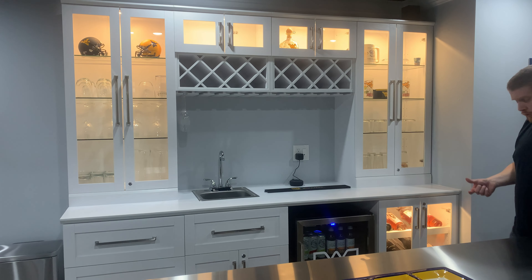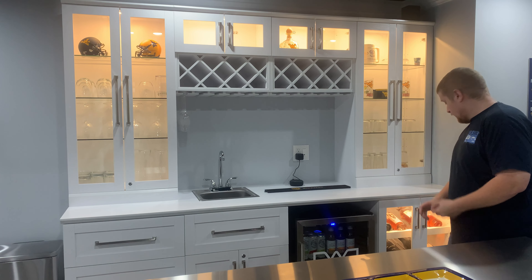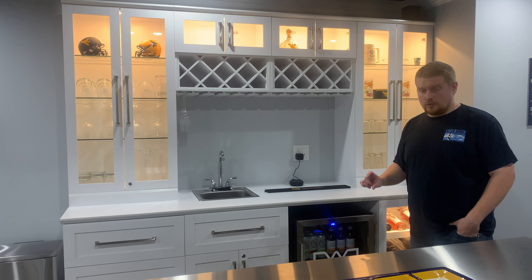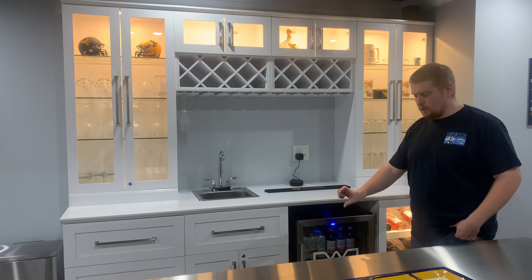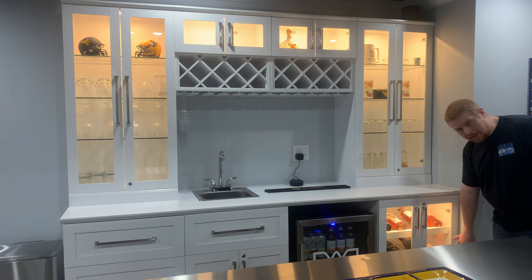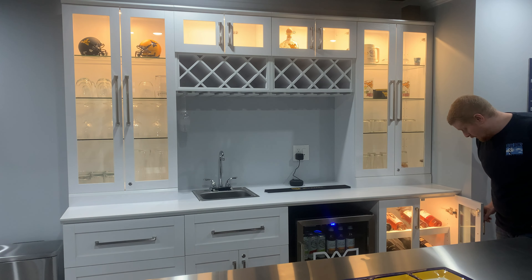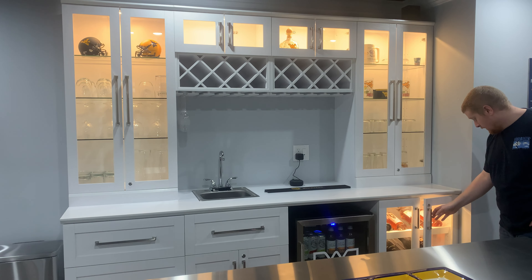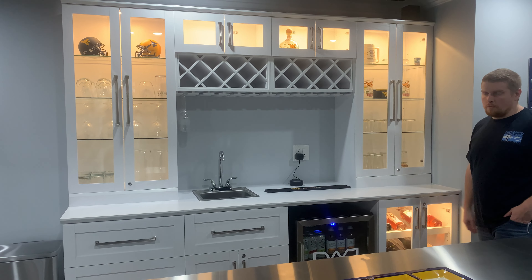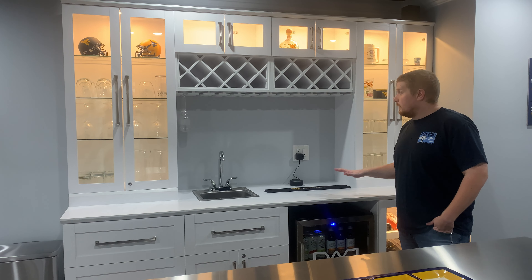Now on your base cabinet, the toe kick is a little slim. Our baseboard is a five and a quarter, five and a half inch baseboard — it's probably a good couple inches taller than the toe kick or base plate on these. So this wine rack down here, I had to do a little bit of rigging to get this piece of the baseboard cut to allow this door to open because of how low that door actually rides. But it'll still swing open very nicely butted right up against the wall.